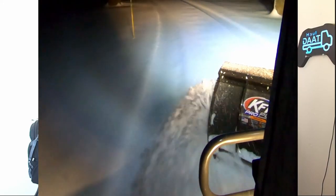As you can see from the b-roll clips, it does a nice job pushing everything out of the way. As long as your UTV has decent horsepower, you shouldn't have any issues. I was worried about rusting — the Pro Poly blade has a poly blend coating over the steel that has done a great job preventing chipping. At the end of the season, I wash it down and spray car wax over the whole blade to protect that coating. It's probably a little overboard, but I like buying things once and not having to replace them.